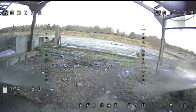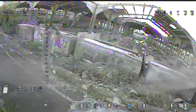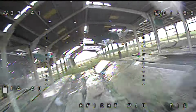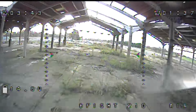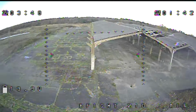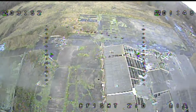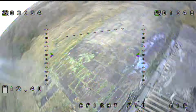Reassuringly, all the soldering throughout the model is exceptionally clean for the price range, and obviously done with care. The ESC is a 30 amp with a 35 amp burst, and that's also stackable sitting at the bottom, so it's well out of the way of harm from any tumbles, of which this one's taken a lot so far. It's also D-Shot 600 compliant, so there's zero calibration with smooth throttle range and really pleasing resolution throughout the entire range too.